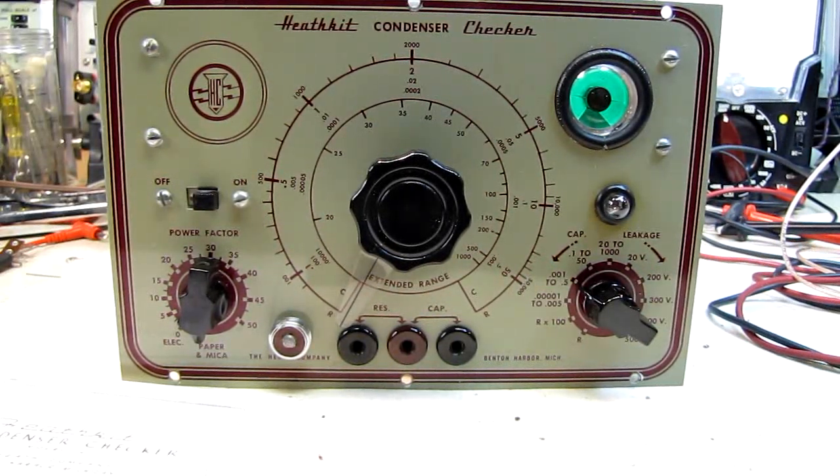Worst case scenario, I could have gone all the way down the voltage divider and boosted that up to 600 volts. After I did this, I went online, did a little bit of research, and found that people have pushed these as far as 1,000 volts. I don't know if I'd go to that extreme. But if you're trying to get the tube working, it beats buying another eye tube — these things are getting rarer and rarer every year and the price is going up and up.